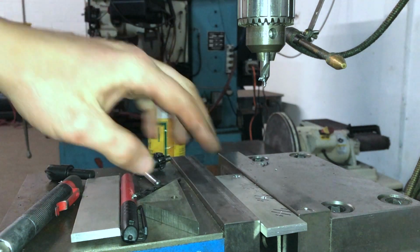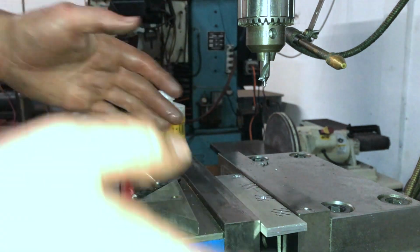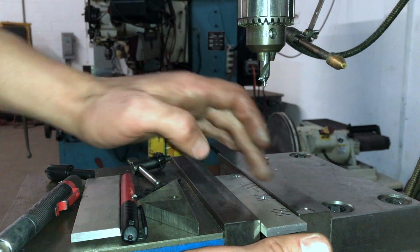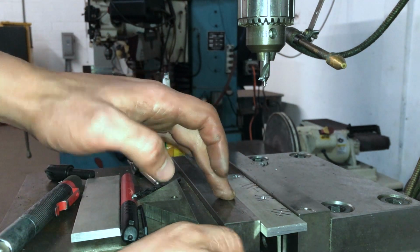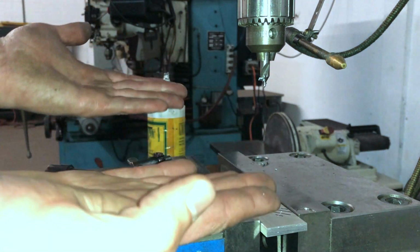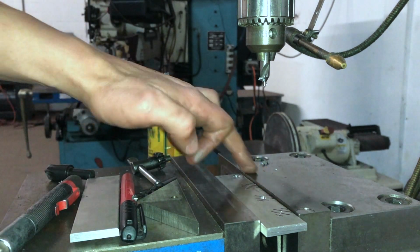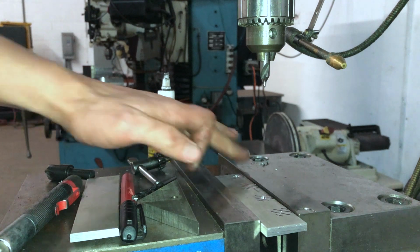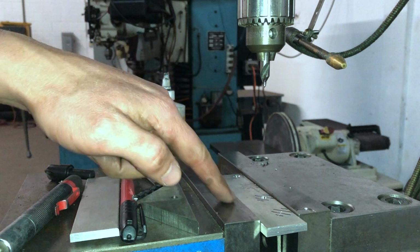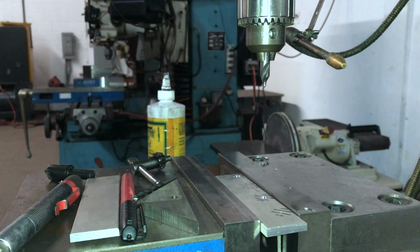Also, a quick note, whenever you're milling or drilling through a hole in a piece of material that you have set up in the milling machine or in the vise, generally you'll have parallels underneath the material. So if you're drilling too close to either vise jaw, make sure you're not going to go through the parallel, because then you might instead want to set up blocks that sit on the sides to still hold the material up as far as you need, but you can still drill your through hole and not have to worry about drilling into the parallel. And of course, especially if you have an end mill, make sure it's not going to touch or cut into your vise jaws. Unfortunately, someone, I'm not going to name any names, but they already accidentally cut about 10 thousandths off this half inch section all the way down this jaw.